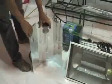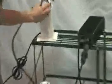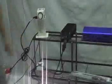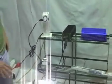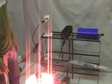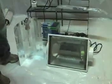We're gonna test this particular light, plug it in, and turn the dial, make sure it works. And in this case, you can see it fires up right away and gets bright relatively fast because we're using an electronic ballast. If we're using a magnetic ballast, it's going to take a little longer for the light to get bright. Okay, we have different types of reflectors.